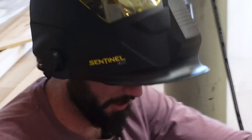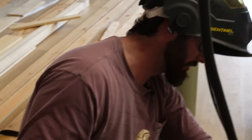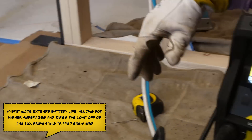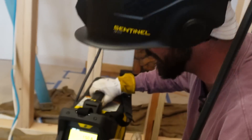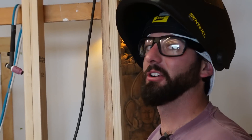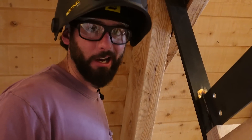I didn't even realize we didn't have one of the batteries in this Renegade Volt — we were running only off 110. We've got four fresh batteries in now, so we'll see if hybrid mode gives us a little more power for these plates. Hybrid mode means we're running off 110 plus the batteries — this helps prevent any breakers from tripping and saves battery life at the same time. So as soon as you plug in your 110 or 220 with the batteries, you're in hybrid mode. Running a 100-foot extension cord, this could really save you when you need all the power at the end of the torch. We're going to do a second pass in case anyone extra meaty wants to hang and invert themselves.